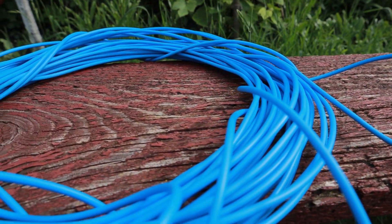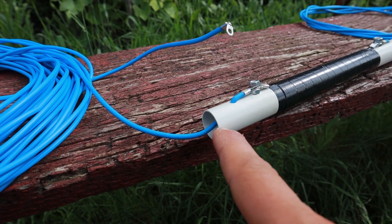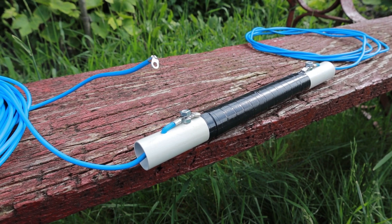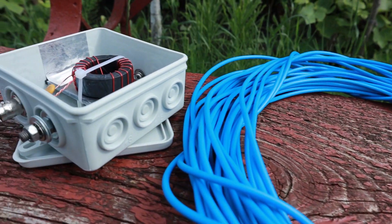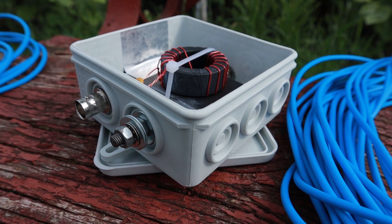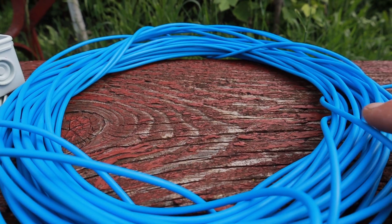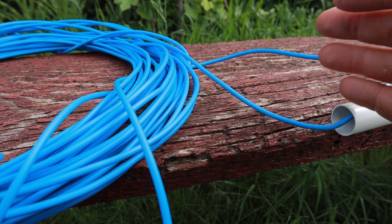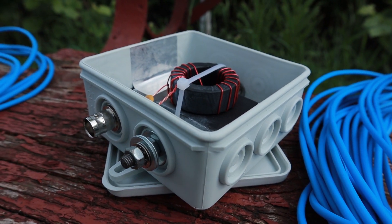Basically what the antenna is: it's a regular 40 meters band end-fed antenna, and then you add the coil and the end section to create an 80 meters band antenna — and pretty much that's it. The antenna I have right now installed up in the attic and garden is just the 49-to-1 impedance transformer and the wire up to the coil — I don't have the coil and everything else. That's why I'm replacing it, so I can test the receiver on more bands.